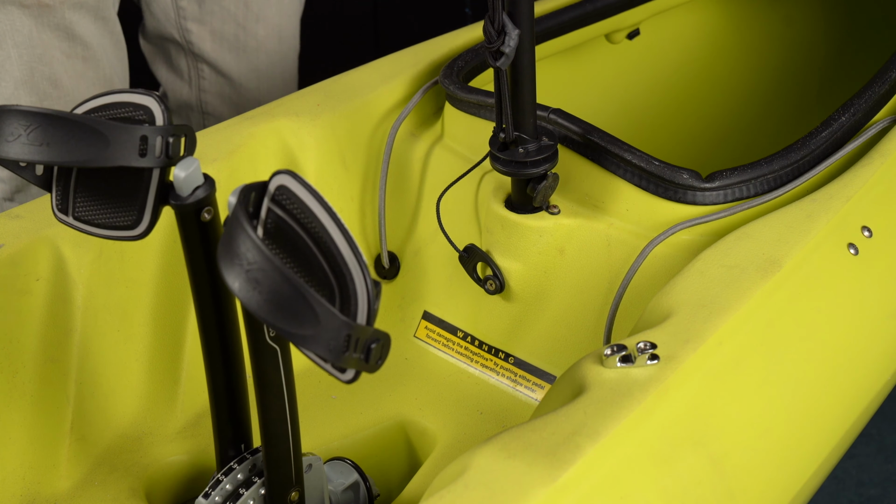If you don't have one of these eye straps available, they're usually located around the boat. And once you see what this looks like as I open it, you can open it either by using the needle nose this way, or since I'm not gonna reuse this one, you can also loosen it with traditional pliers. We'll just simply thread this out, and you can see it's a dry socket, so nothing's ever gonna leak inside the hull through there. I'll thread this one in place.